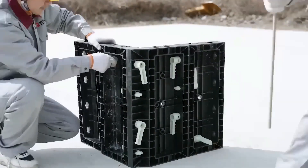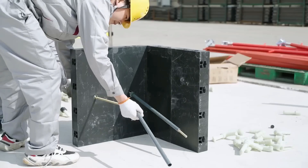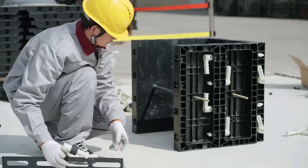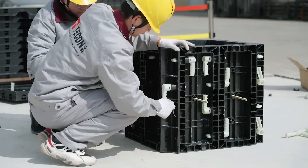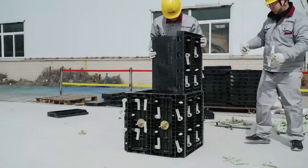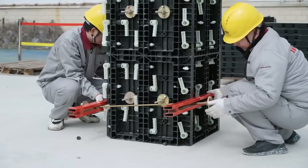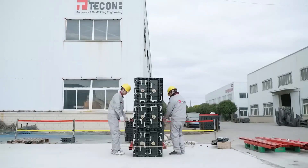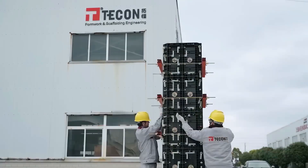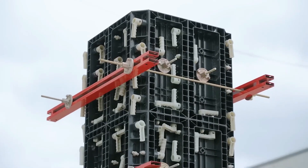This company offers plastic formwork TP 60 Plus, plastic adjustable column formwork, and plastic round column formwork, catering to diverse needs. With a remarkable daily productivity of up to 40 square meters per person, it finds extensive application in remote areas inaccessible to construction machinery or sites lacking a crane. The specific plastic grade prevents any chemical reaction with poured material, ensuring a spotless surface on the reinforced concrete element.